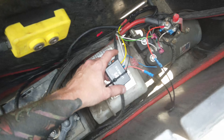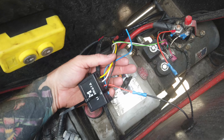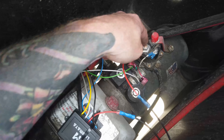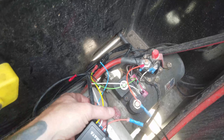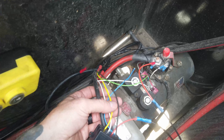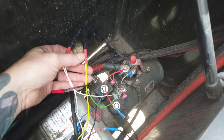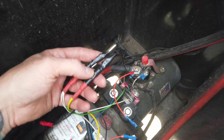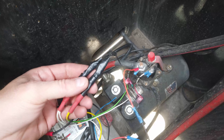Basically there's a wireless controller zip-tied to a wire inside the box. If I zoom in, you can see the blue wire which is the antenna. There's a red wire that goes to power, which runs to my switch, and from the switch it draws off the power for the hydraulic pump. There's a black wire for ground that goes over to a ground spot, and then two more wires — a white and a yellow — that I daisy-chained. I wrapped them in electrical tape to keep it somewhat watertight.